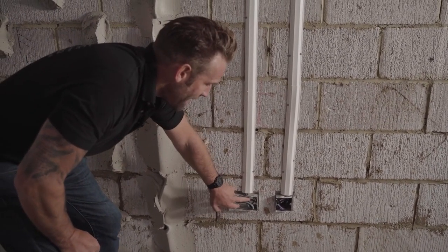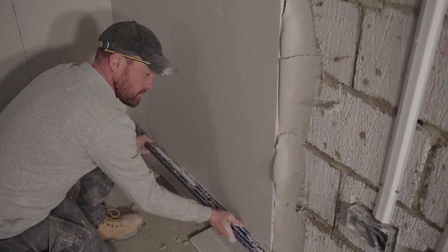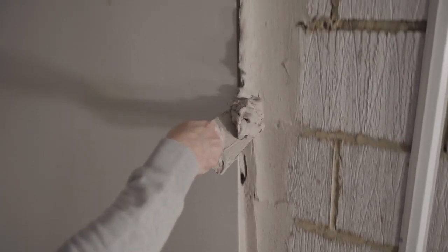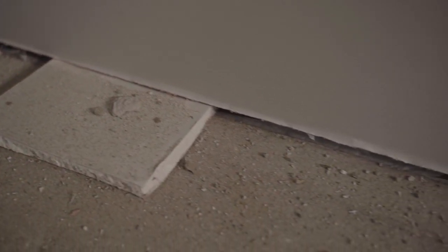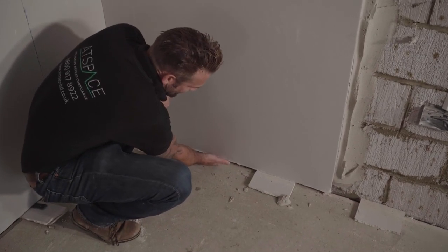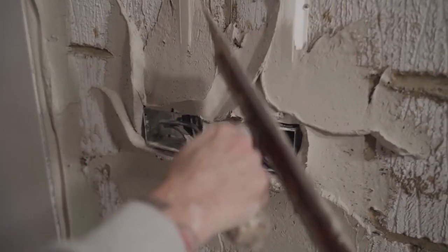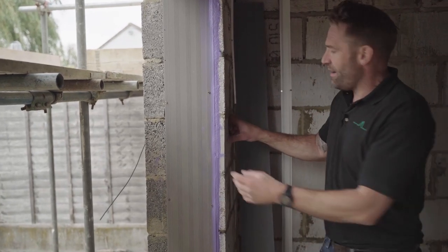Also a quick note: we've got a 15mm gap at the bottom of the board here, raised just to stop any moisture that falls on the floor from travelling up the board. In regards to airtightness, expandable foam or similar products down in this gap will assist.